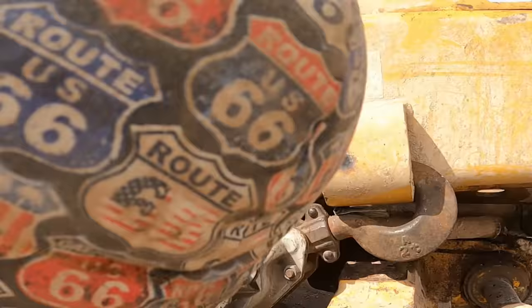So what's nice about using flux core or any type of wire is that you're able to let it cool off between pulses just to where it solidifies. And if you're watching the weld really well, you can tell when the molten puddle solidifies, and then you can hit it again, just like instantly. It's still orange, or still red, but that's when you hit it again. Just enough to where you can control that puddle all the way up without making a mess. Because trying to stick weld that and control the weld is very difficult. So this is the best thing for it, at least.